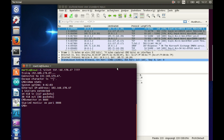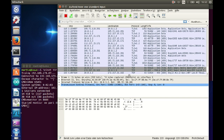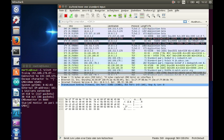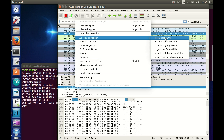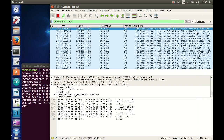Even more traffic comes in when I open an app — actually a weather app — which shows the current weather and lots of advertisements. Now for example you can use this monitoring feature to figure out to whom your application is talking. I pick a DNS packet and set a filter on DNS — port 53 — and filter out all DNS requests. And here we go: we have all the DNS requests of the last seconds. There you see all the sites that the app is connecting to just to get a little bit of weather information. This is a nice application of the ESP repeater.